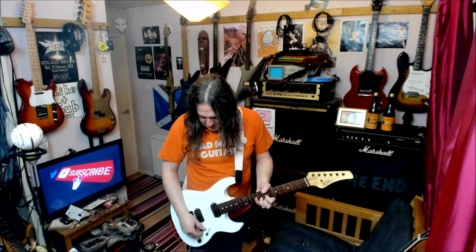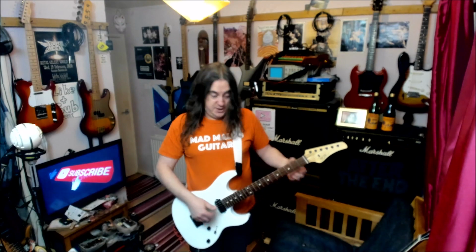I mean, because Scott's mad into his pedals and stuff like that, I can see where the treble bleed comes in though, because it just gets louder, but it doesn't change sound. Whereas when you don't have the treble bleed in, when you turn it down, it acts a bit like a tone control at the same time. So it's like, yeah, it sounds louder. That makes sense.